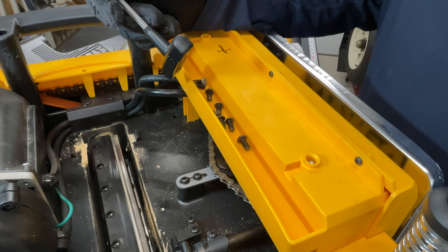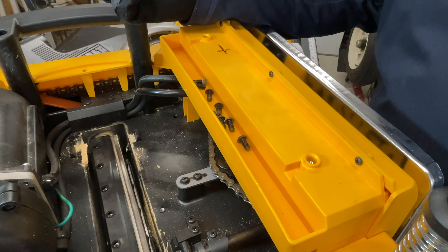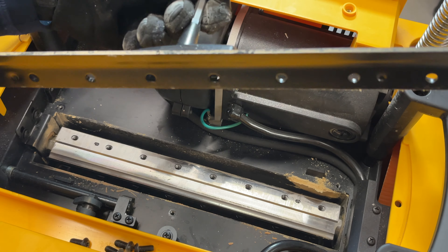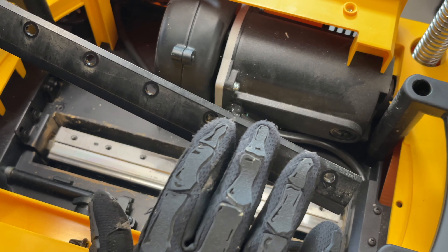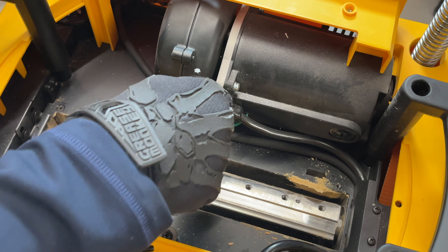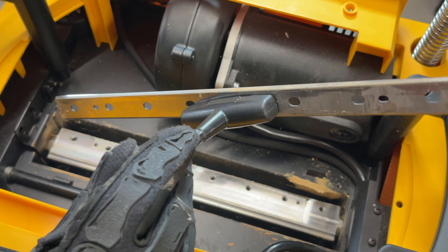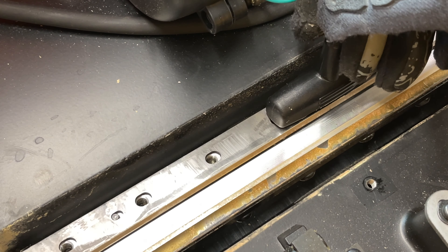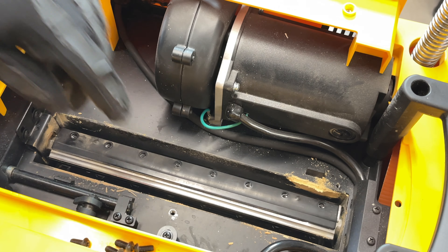A built-in small parts tray! Let me know in the comments if you own a tool with a built-in small parts tray, because DeWalt just won't give me anything to complain about. The magnet on the tool is strong enough to pick up the bracket — and the bracket's heavy steel. It has a beveled edge and a flat edge; the beveled edge is the edge that goes with the knife edge. We'll set that down in the same orientation so we don't screw it up. And there's your blade — basically a razor blade. We'll spin it around; it's got a couple oblong holes so you can align it. We'll take our bracket, set it back down, and put our screws back in.